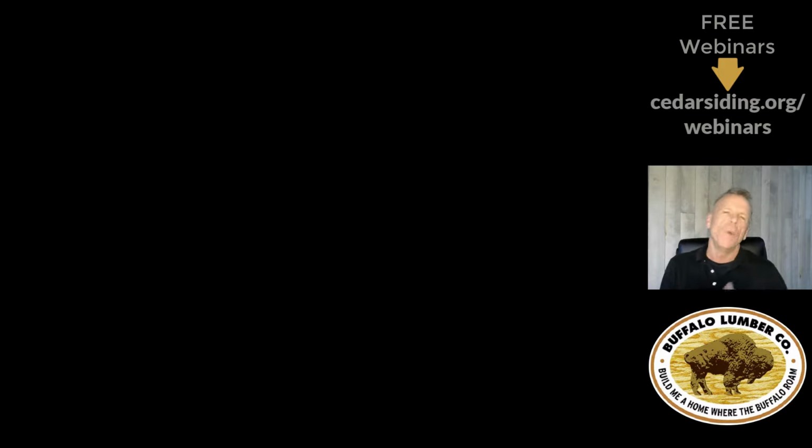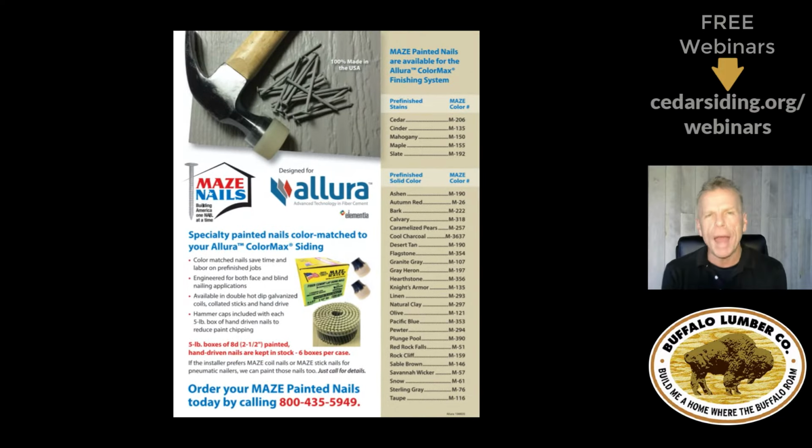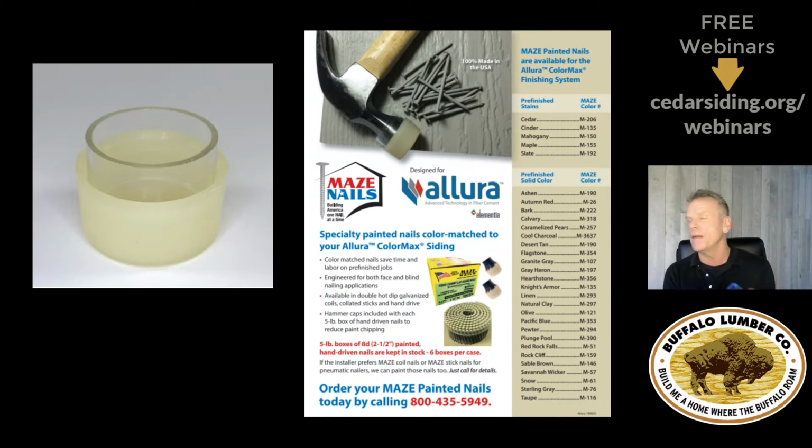However, if you want to go that route and stay on the Craftsman route, they do have an entire line of colored nails. Maze makes an entire assorted color line of nails for both stains and paints. If you're going to use the colored nail system, you need to have little plastic caps, hammer caps, so that you don't chip the paint on the nail once you use them.